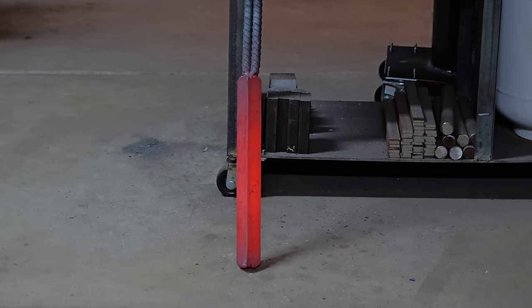The last thing I had to take note of was how clean my transition between the blade and the front of the bolster was — that transition is so easily overlooked but it adds a level of depth to the piece that I wouldn't have otherwise. One more thing to note: on a mosaic Damascus piece like this, it's actually really important to have the spine at a high polish because there's a really cool pattern that you see on the top and bottom of the blade.